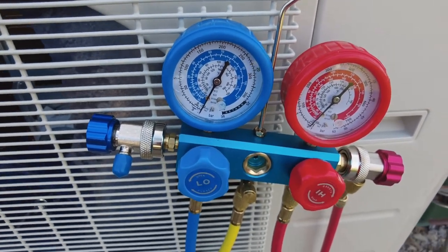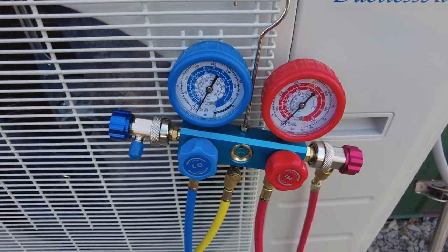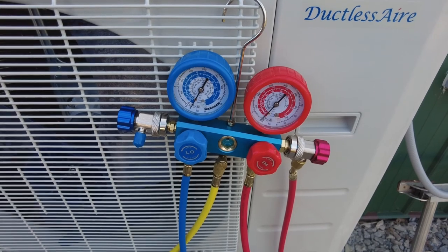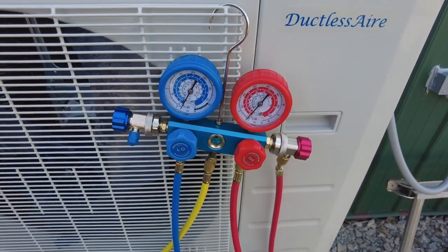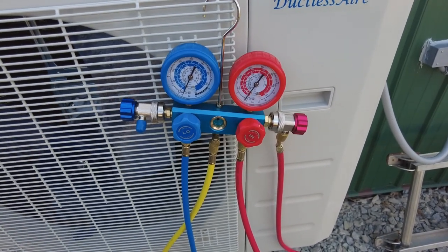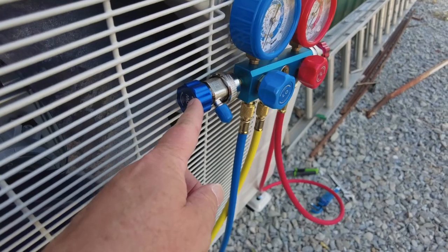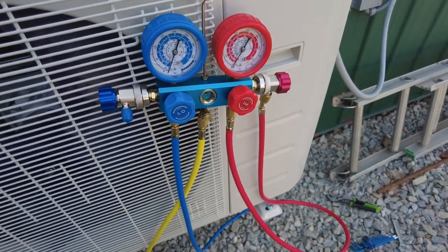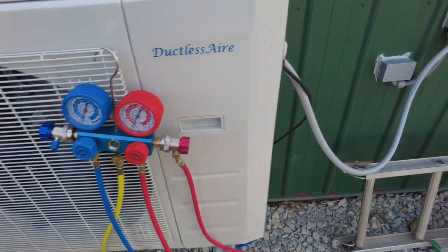Now, I'm just going to follow some of the other people's instruction I've seen as far as releasing the gas. I read the manual and it stated basically leave your line set hooked up and release the gas to make sure you got some pressure in there. But I think I'm going to skip that just to make sure I don't lose any and disconnect this set. Now, one note I wanted to mention to you because I found it to be a problem is I had these side units hooked up and I had this one open and it was causing me vacuum loss, so I closed it and it solved my issues. So holding steady, that means our lines are airtight and are not leaking, so we'll go ahead and move forward.